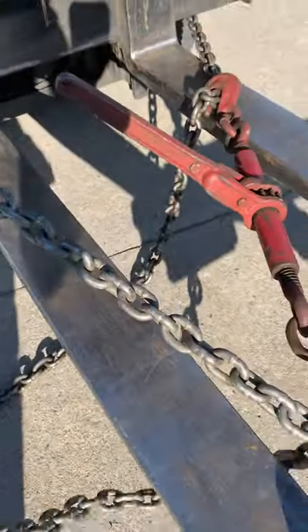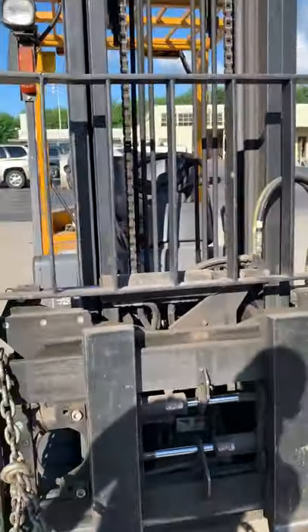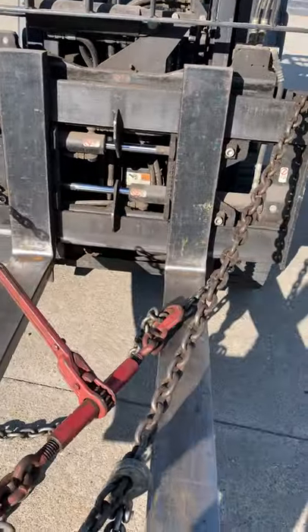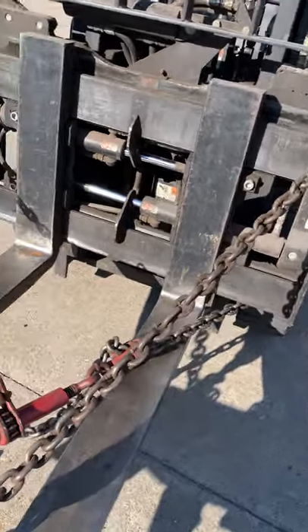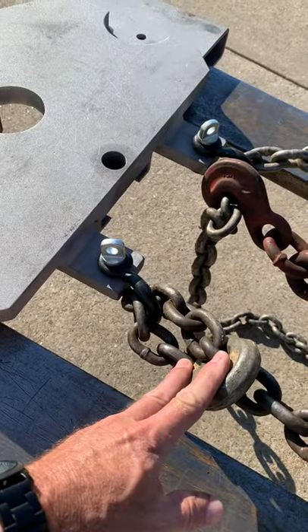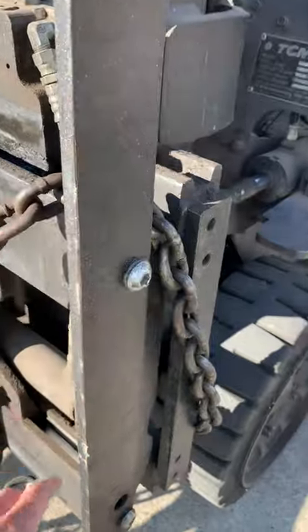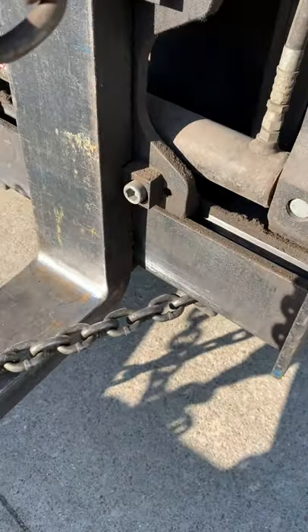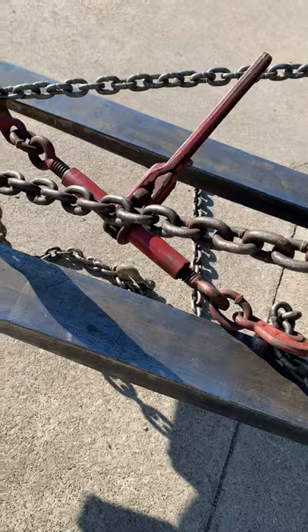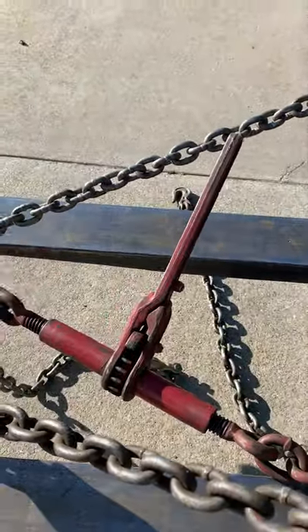The leftover end of the chain, I'll probably hang somewhere on the guard there. I did the opposite on this chain — I short choked it here by the clevis, then ran it through the fork mast underneath, and then hooked the other end of the load binder to that end, and cranked the load binder tight.